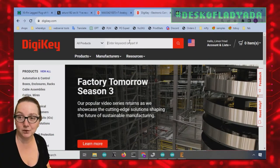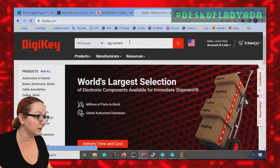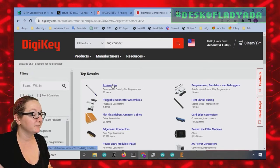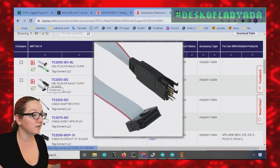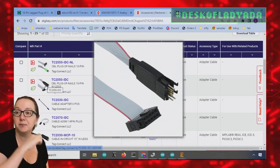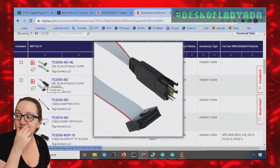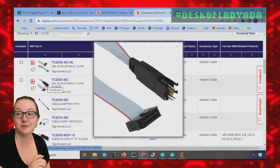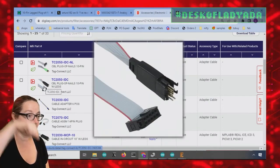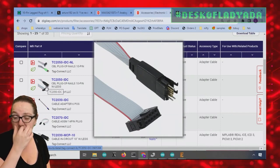Personally I just go with a 2x5 connector or solder pads, but Tag Connect is very common and there are ready-to-go footprints for Altium, KiCad, Eagle, whatever. The most common configuration is the standard 10-pin SWD. They give you a cable that goes into the standard J-Link, MCU Link, STM Link — everybody's got their own brand of programmer, like CMSIS-DAP compatible. This will work with them, and it's $40 — an investment, but reusable. It's also very often used in manufacturing lines.